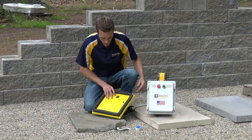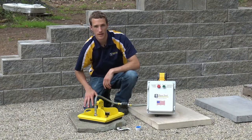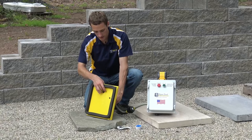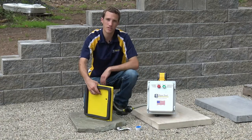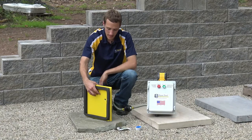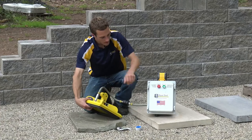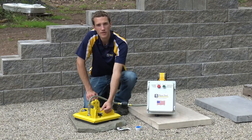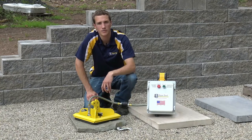Make sure the pad is glued up and making a good solid seal, then work back toward the power pack. The next area for air loss can be through the air fitting or the fittings going into the pad. To test this, stand the pad up on end, take your finger and stick it into the hole to seal it off, then turn on the power pack. You should feel a little suction on your finger, and it should hold air for about a minute and a half to two minutes. If it does, the power pack is holding air and the loss is through the pad. Also check the suction gauge — since it's another hole in the pad, remove it, cover that hole, and confirm no air loss. If there is loss there, some pipe thread and screwing it back on should solve the problem.